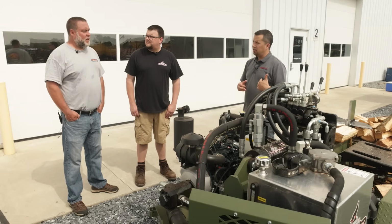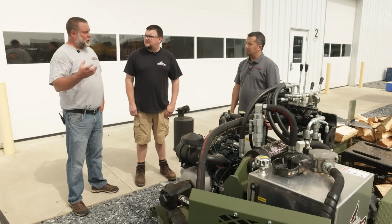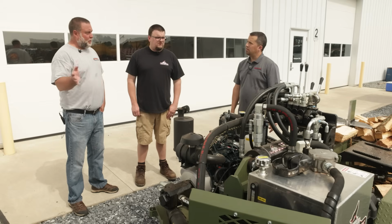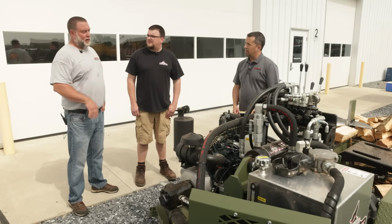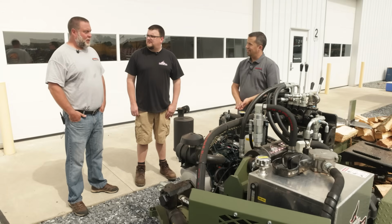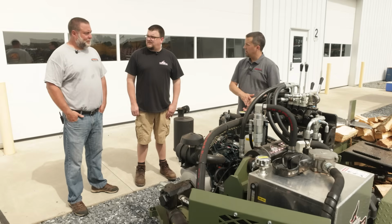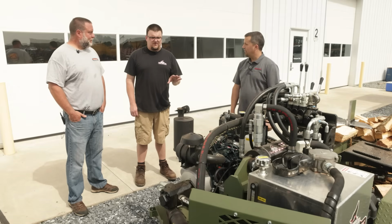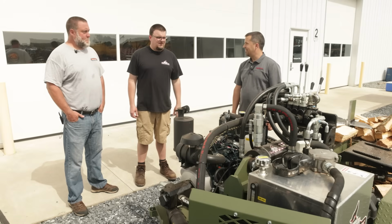It definitely does. With the gas engine, it would pump down. You would see the pressure drops and the push through in the two-stage. With the diesel, it doesn't matter if I run a crotch white oak through it or a poplar. It's just smooth sailing. I did hear stage 2 a couple times when you were running it, but the engine didn't care. No, it's not dogging down.